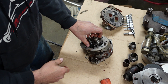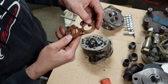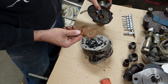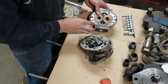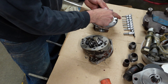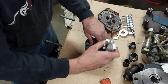Here's our plate. The other one — they were brass — these have a brass face on a steel plate. And you can see there's a lot of cavitation here; it's got metal blown out on the pressure side. This cap sits like that. Now there's an O-ring missing here — I knew this part was junk. It seals around here, just a seal, and there's an O-ring on the outside. Then you have your gears. This is a gear set just like the others.